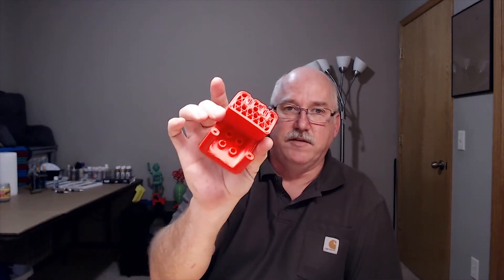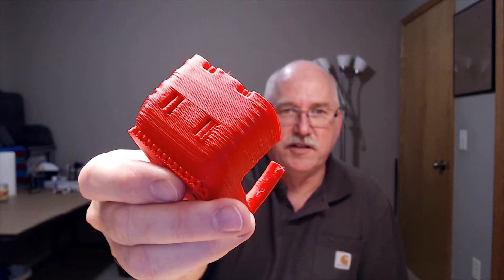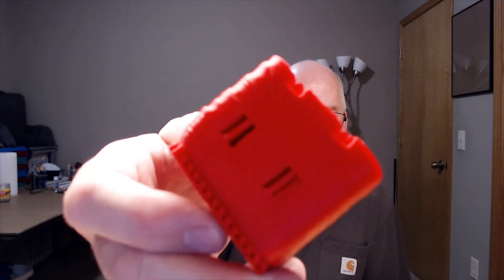So I was printing with it, just kind of moving along, wasn't really paying attention. And then I got the nozzle going — you probably saw my previous video when I started messing around with the 0.8 nozzle printing at 0.6 layer heights. Started learning a little bit what you can't do that well. It's kind of messy, and the edges started getting all kind of funky.